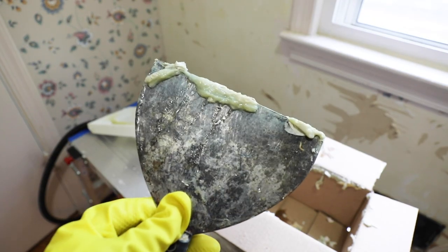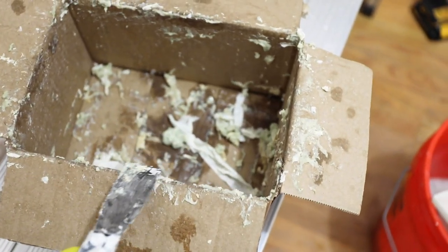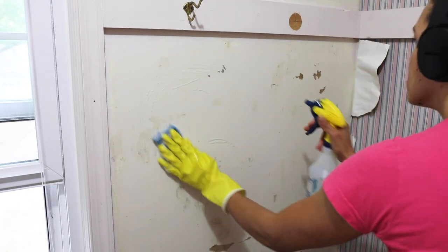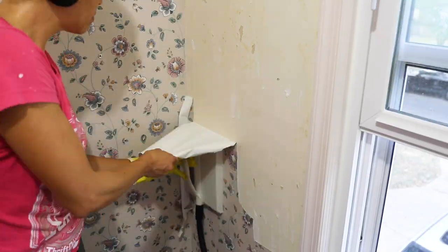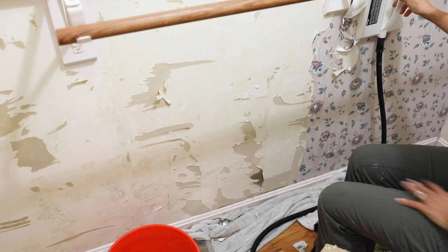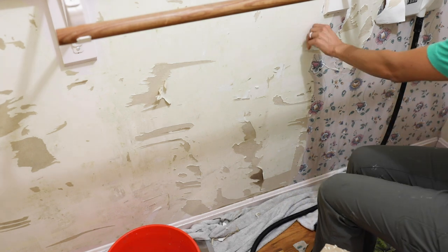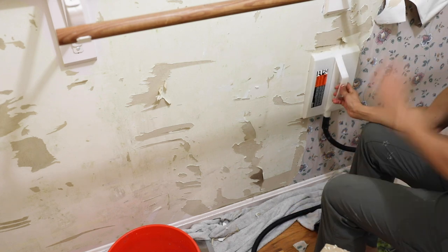This is what it's going to look like — it is gunk, thick glue. You need a box or something you can scrape that stuff off into so you can continue scraping it off the wall. Once you've scraped all the glue, take some Simple Green and just scrub the wall down with a fresh bucket of water. Here's an example of what happens when you become really impatient and start peeling things off before they're ready — you will get a ton of brown paper bag areas. This could also mean you need to put more water in your steamer, because as it runs out, there's less steam and the wallpaper won't come off easily.